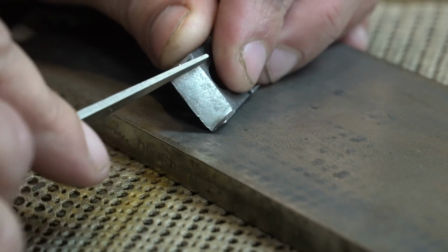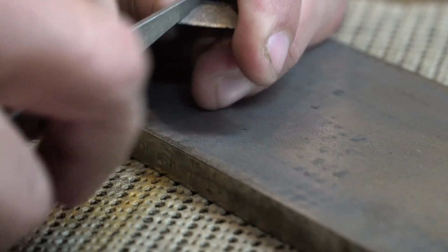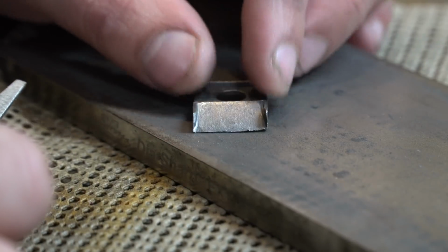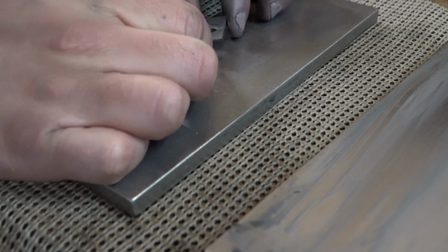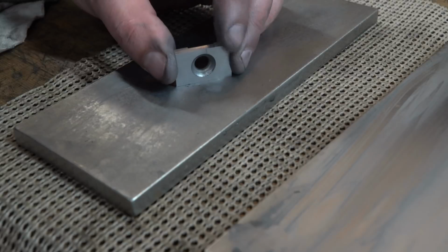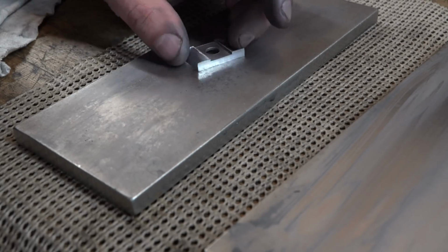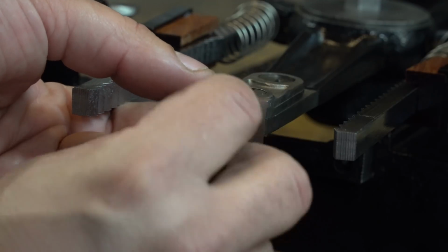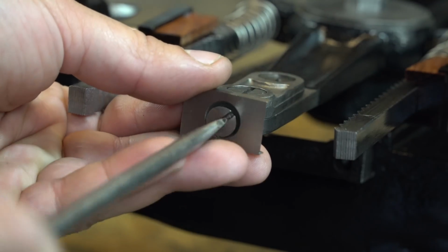Now, to sharpen the tiny, tiny cutter, which is a little bit damaged, I'm going to have to take off a bunch of material. But I'm going with my auger bit sharpening file, which is literally perfectly designed for this. And then I'm using my diamond stone plates to go up the grits to sharpen 3 sides as much as I can to get crazy, crazy, crazy sharp. So we have a super useful tool to actually cut some wood. The cutter definitely needed a major, major sharpening. It's just brutal.